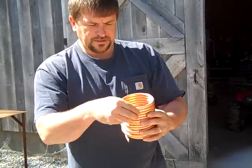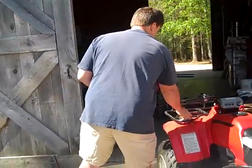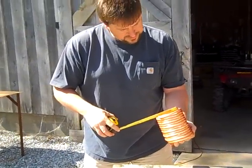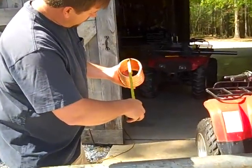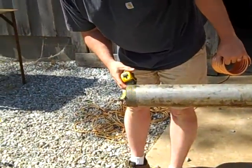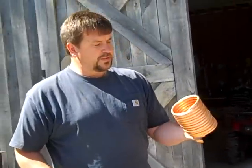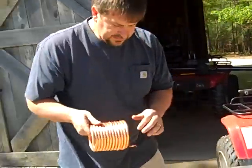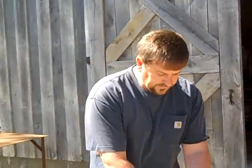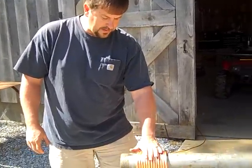I've got a nice 4-inch coil. Let's see what size it actually is. You get some spring back, of course, but my ID is right on the money — 4-inch ID. That's exactly what I wanted. The pipe I used is about 3 and 7/8 inch OD, so with the ice in there you can pull it really tight and you don't get a lot of spring back. No reason to buy anything fancy. No reason to buy a casting compound — just fill it with water, freeze it, bend it. Done.